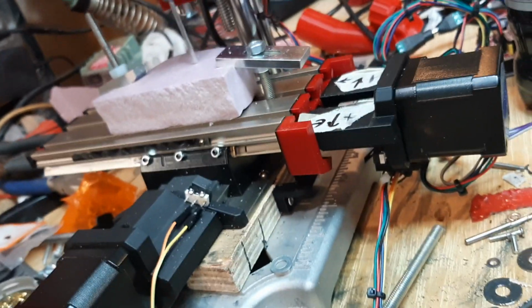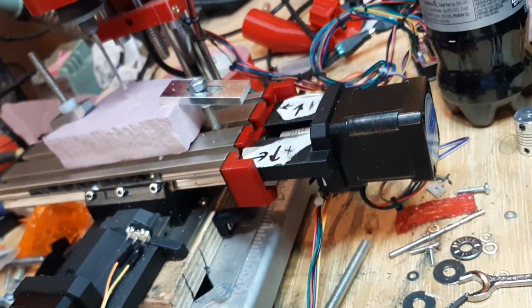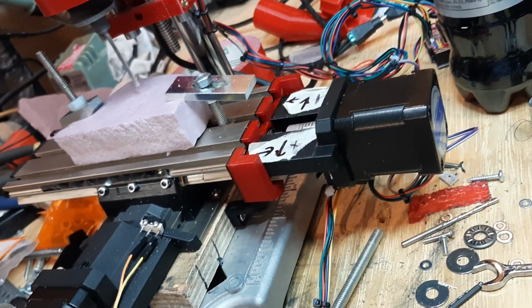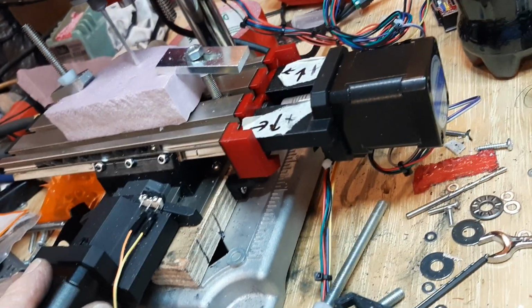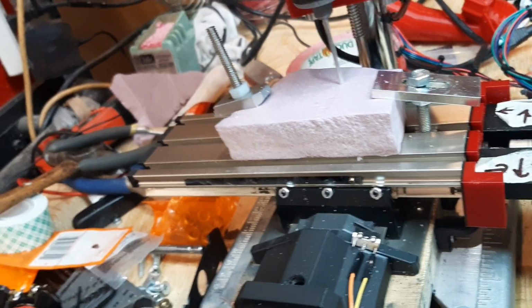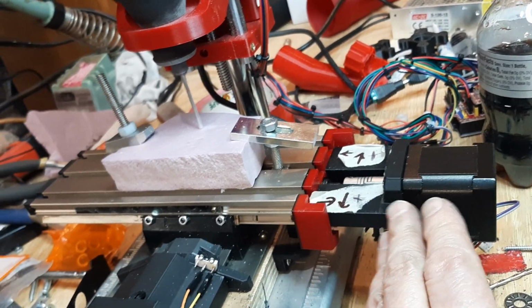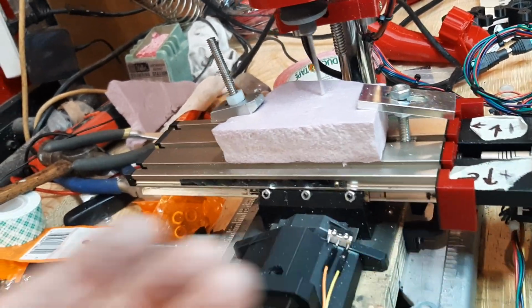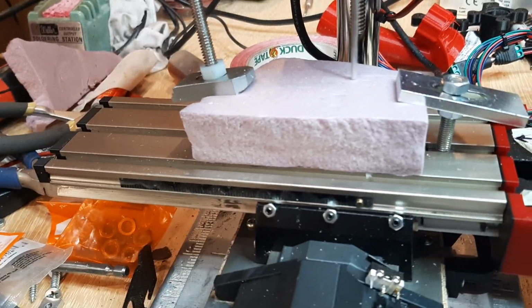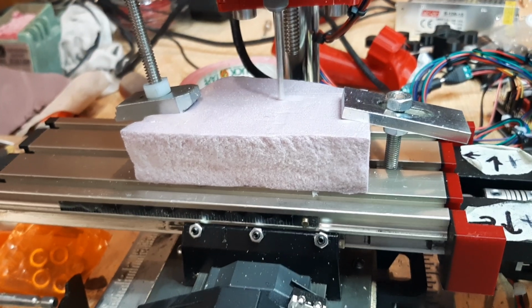But I checked my dimensions, the backlash and whatnot, the feed rates, and I'll tell you what, I'm having trouble getting accurate information from either my eyes or my calipers or my brain or something. So I did some changes. I've made some improvements, I think, in accuracy, but I'm just not able to do it right now. I think I'm going to fix this part next, and then attach that to here with some screws, see if I can't get this maximum stiffness. And I still think my inside nut the threads are loose on the drive shaft, so what I think I need is a brass nut for that.